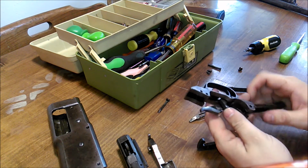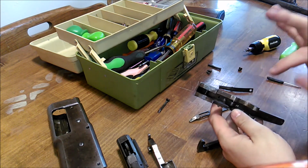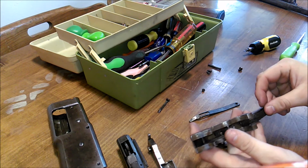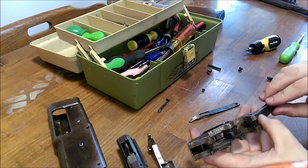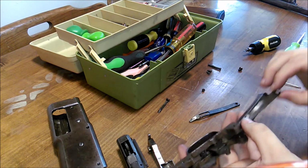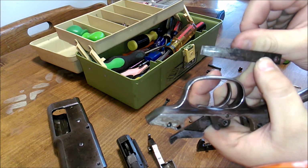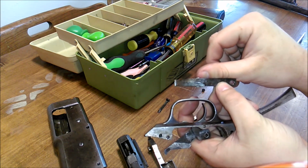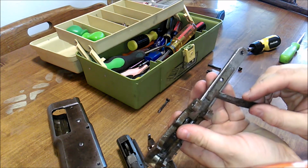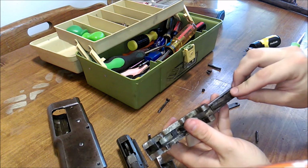So, pretty easy. Just assemble, clean everything, scrub it the heck down, and assemble that pin straight through there. And put your secondary spring in there. There's two notches on the side of this that you can see right there. The end of my thumbnail. I don't know if it's going to show up very well. There we go. These notches slide right into these two little groove things, one and two on each side.